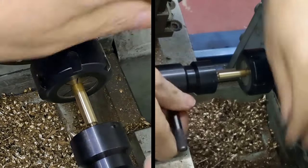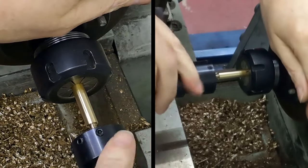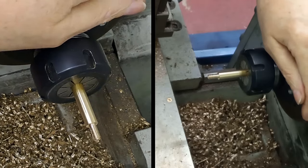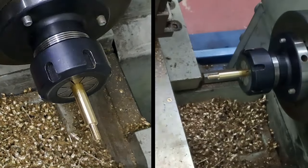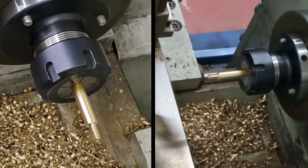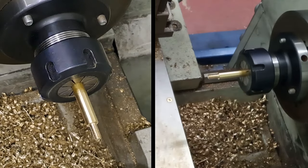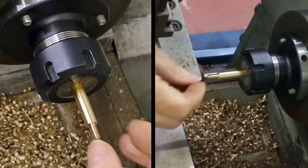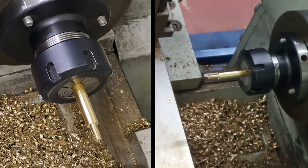And once I put the thread relief in so that the oil cups will sit right down onto the valve gear when I get that far. But I'm just doing this at the moment because I've got the lathe covered in brass chips. Rather than clean the lathe too often, let's just keep working with brass for the minute. And we're working on the axle pump anyway. I think you can see by now we have a nice crisp looking thread there. Again, yes, there's a couple of knackered threads at the end there.